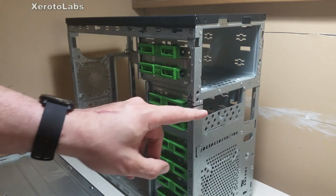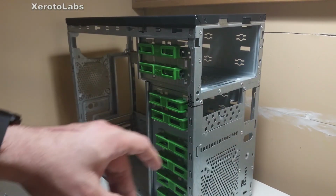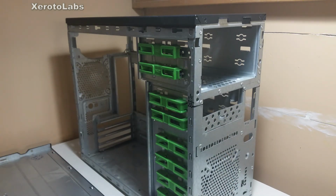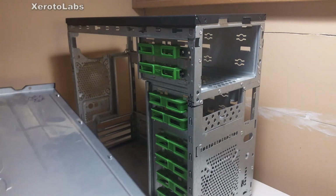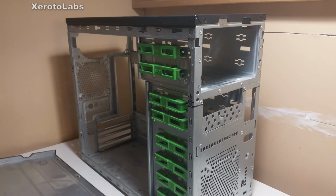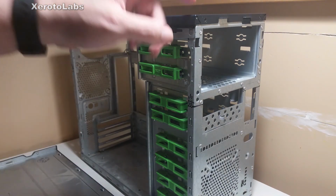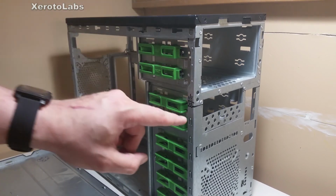What we're going to do is cut around all that with an abrasive disc saw, and I'm going to cut the side panel. You only need one side panel because when you cut it you can flip the bottom. If I cut this, the bottom is a mirror of the top. So when I cut this into 2 pieces, I can use one on either side. That'll be the new sides. I'll cut those down to total height, but I'm not going to cut this until very last because I'm going to want to know the total height from that to the bottom.